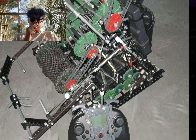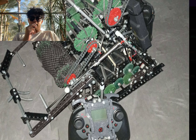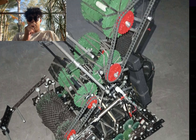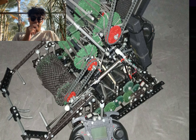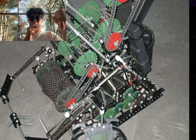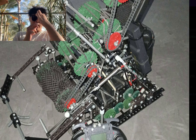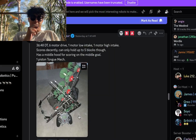Other than that, it's pretty solid. I like how you bent your standoffs. Nice scuffs, too. Driver chain setup — it's alright. I guess he didn't have all high strength gears or all low strength gears, but that's good. Maybe it's because he doesn't know how to drill. If you want to use low strength gears as the free-spinning low-friction gears, you can just take a drill and drill straight through the low strength gear. Make sure to drill in the middle, and make sure to drill it straight down so it doesn't deform to the side. Then you can just run your low strength gears as your connecting gears which don't get powered — really, really low friction as well. That's a small tip. I'm gonna give this one an A-tier.